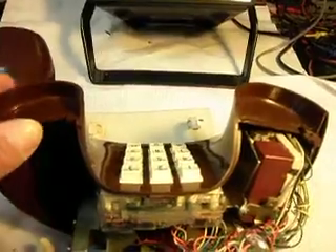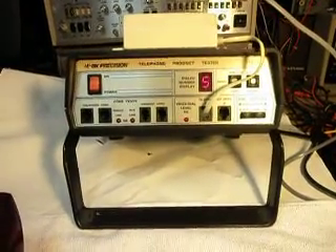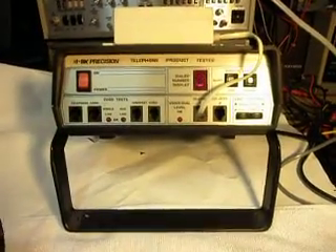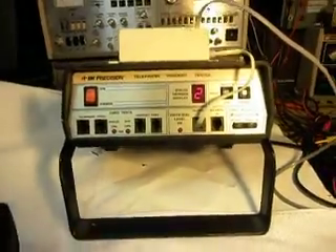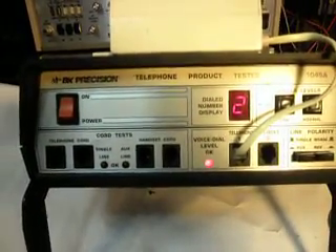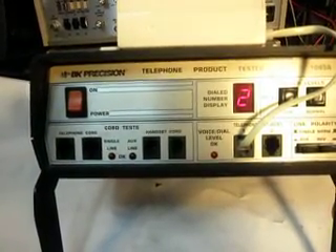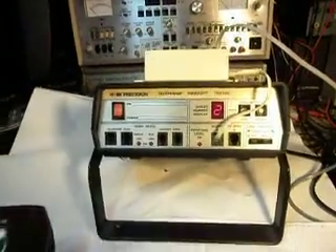Now I've got the keypad here — we'll do some numbers. I'm going to do these backwards. We're going to hang up. I'm going to go to a two and talk into the handset here and you'll see modulation on the analyzer. Every time I speak, you'll see the red indicator light — that's 100% modulation. Hello, hello, hello. So we know all that's working.